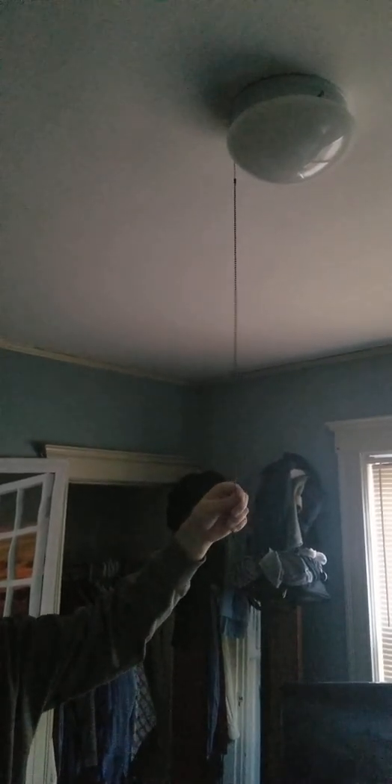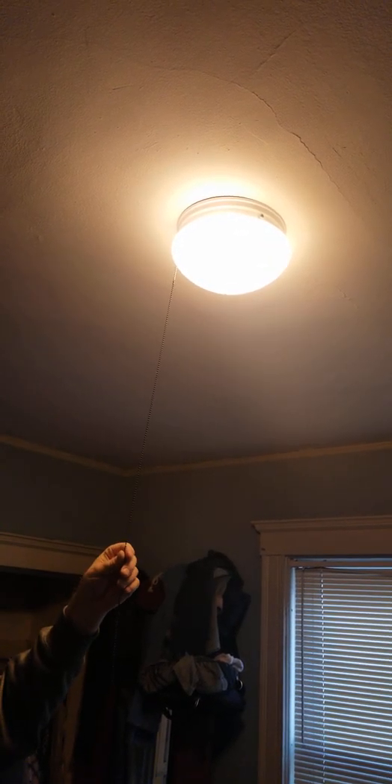Okay, so like I said, we've got black leads connected, a white lead connected, and then the other end of the switch going up to the wall. Now we're just going to reconnect and give it a test. We have it all back up. While I had it down, I cleaned the globe — you do these little things on jobs, don't just let it stay dirty. I mean, you're here. So we cleaned it up. It was all dirty inside with dust all over it. Cleaned it up the best we could, got it looking good, and we're back to operational here. Thank you, Fix-It Land.